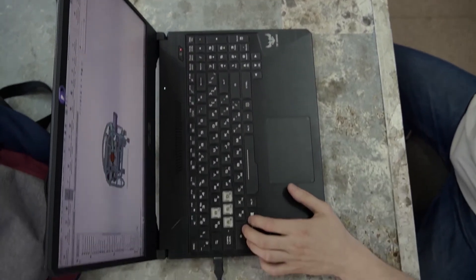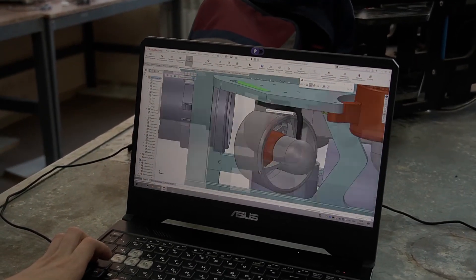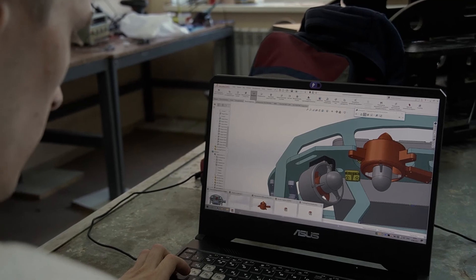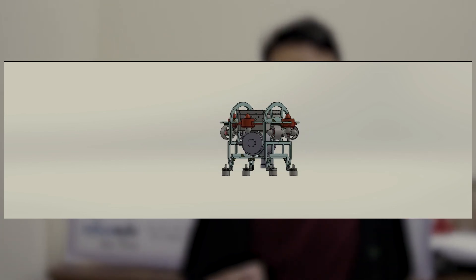When designing the carrier frame, special attention was focused on its weight and size characteristics, simplicity in maintenance, and lightening of construction. An 8 mm polypropylene plate was chosen as the basic material for the AUV frame, keeping in mind the payload fixed to the frame for specific competition missions. This material is lightweight and has enough toughness. Another approach to reduce the weight of the AUV is the creation of the electronic block housing by 3D printing from PLA material. This technology is not often used in underwater engineering and can be considered experimental. The advantage of this approach is relatively easy integration of new electronic devices. To provide the required seal, the electronic block housing is treated with solvent after printing to eliminate micro-cracks and pores.